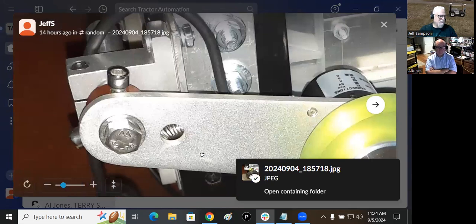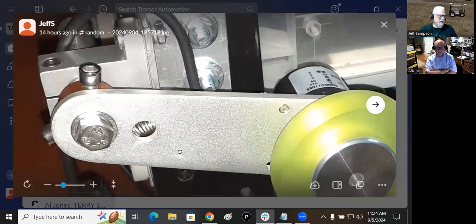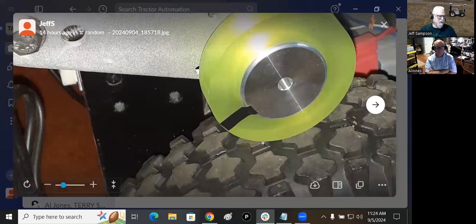here's the thing that I bought on Amazon. It has this T-shaped aluminum bracket that you bolt onto a frame somewhere. That's got this long steel shaft through the side here. And when we look at the next picture, you can loosen this set screw and then slide it in and out, so I can get lateral adjustment to get the wheel over the center of the tire.